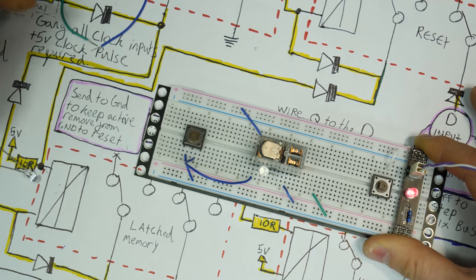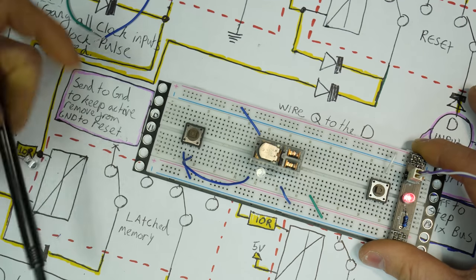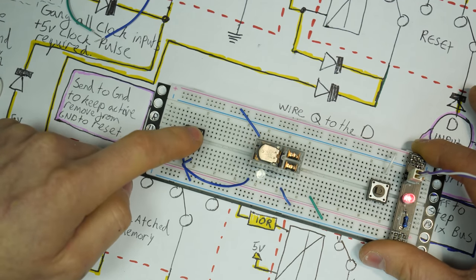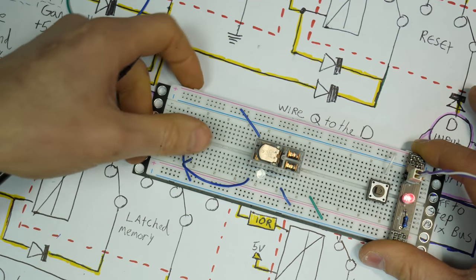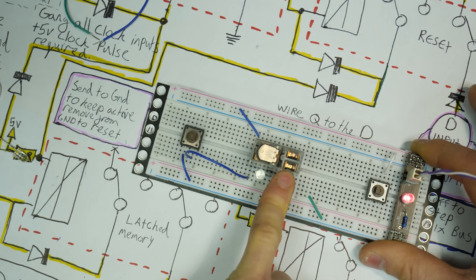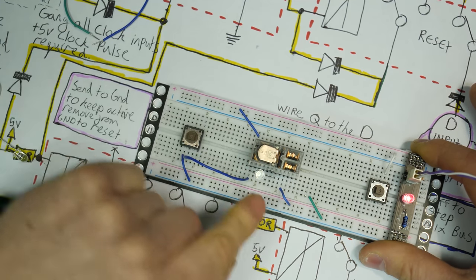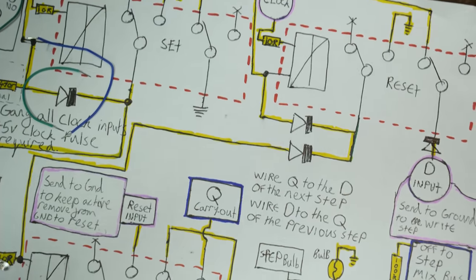So the thing is, if you wire it up slightly differently and make the most of this mechanical delay, and this is shown by this LED right here, you can see I've made this LED basically do a clock pulse, and this is what's inside relay debouncing circuits as well. But this is working on the fact that it takes a little bit of time from the normally closed and the center of the switch to actually deactivate from each other. So you end up getting this tiny little pulse, and you can make the most of this tiny little pulse to actually make these flip-flops right here.